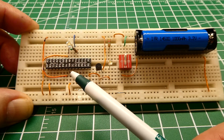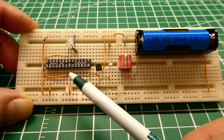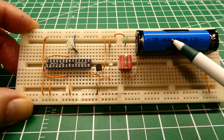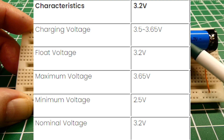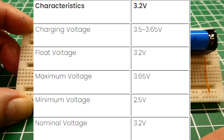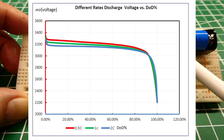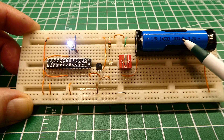I'm using an ATmega328p microcontroller in bare-bones circuitry with no extra components, and I have code running that's blinking an LED. The maximum charge voltage for this battery is 3.6 volts, and when you take it out of the charger it drops down to around 3.3 volts to power your circuitry. Looking at the discharge curve, it stays around 3.3 volts and then eventually starts dropping — I want it to trigger at 2.8 volts.